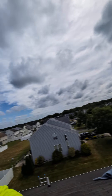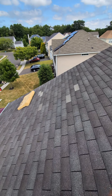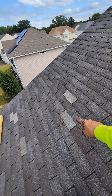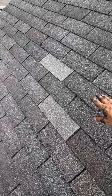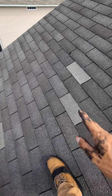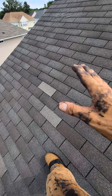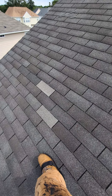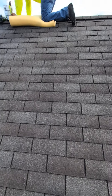It turned out to be a really gorgeous day — not much sun — and we are almost completely done. I wanted to make a video quickly just to show you a few things. When we're making these type of repairs, there are really a few different things we're trying to accomplish. When a shingle is missing, we have water coming in, so we're trying to complete this overlapping effect where water hits each shingle which overlaps the next. When we lay shingles, we start from the bottom and work our way up. What is most significant is that we create that seal again, where any water disperses at the bottom and has no chance to work its way behind shingles.